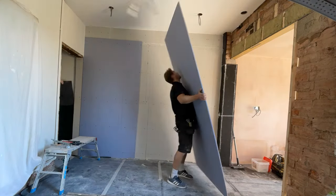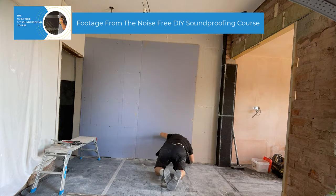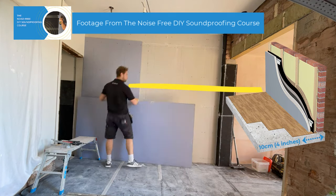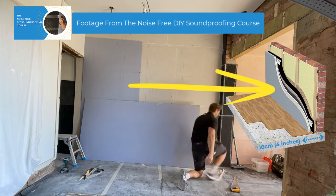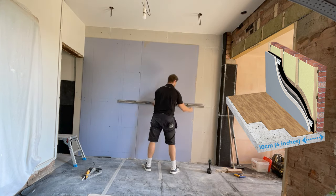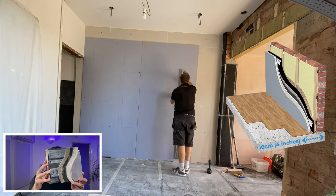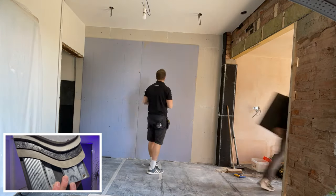Next, install two layers of 15 mil acoustic grade plasterboard, and always install two layers when you use a resilient bar, resilient clip, or channel system. By two layers I mean either two layers of sound block board, or consider putting a fibre board and then a layer of 15 mil sound block board, or even three layers.